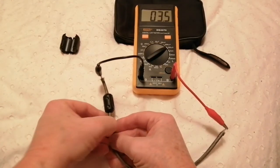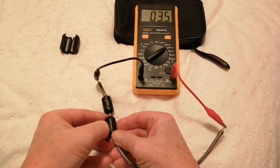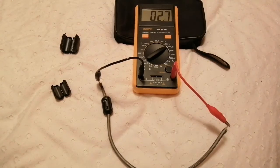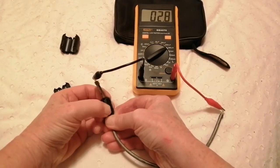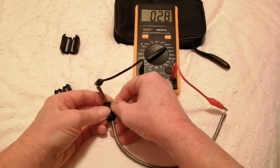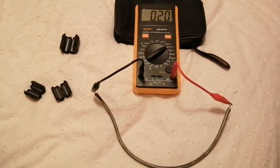Having said that they're easier to take off than put on, I'm about to dispute that. There we go. Now it has affected the inductance on the inner — isn't that strange? You would expect it to, wouldn't you? Let's take the other one off. It's gone down to two. So yes, choking the outer does affect the inductance of the inner, at least in the common mode. It probably won't affect the currents actually inside the cable, but if you're talking about end to end, then yes, it does affect the inductance.